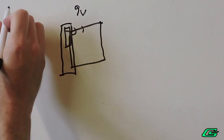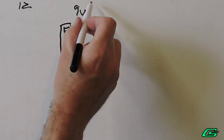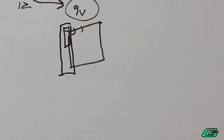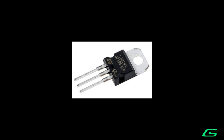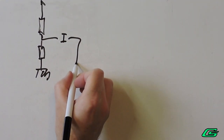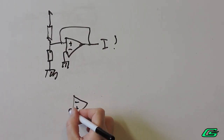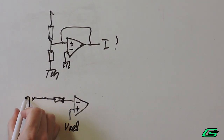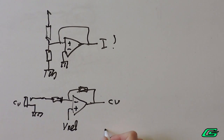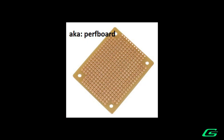Let's talk electronics. The pedal uses 9V of power and Eurorack provides 12V. After downloading the pedal schematics, I've determined that much of the circuitry is dependent upon the 9V reference, and I don't want to replace a bunch of resistors to adapt the 12V reference, so I'll need to step down the 12V to 9V. I've seen others use a 9V regulator, which works fine, but I don't have one laying around. Another way is to use a simple voltage divider — the only problem is it can't push the measly 20mA current for the circuit to operate. So I'll need to add an op-amp buffer to get the required current. If I use a dual op-amp, I'll have another amp to accomplish another task — like adding external CV to control the phaser depth, which would be cool. That also requires a switch to change between the internal LFO and external CV, no problem. There will be plenty of space on the front panel, and all I need is a small breadboard located under the pot board.